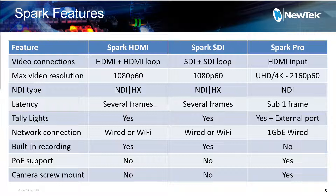As I mentioned, all units have tally lights, but the Spark Pro also has that external tally connector. Network-wise, all of them can hook up wired, but wireless is only available on the HDMI and SDI Sparks. For recording, the Spark HDMI and SDI have ports to plug in a memory card and record directly on the unit; the Spark Pro does not offer that feature — you'd record externally, for example using NDI IsoRecorder or IsoRecorder Pro. NDI IsoRecorder is a free version that records two channels on a PC. POE support and the screw mount are only available on the Spark Pro; brackets can be purchased for the other Spark models.